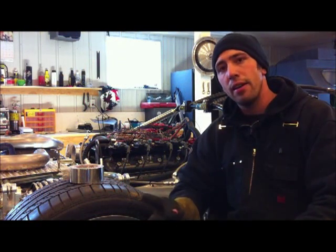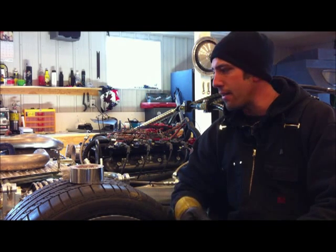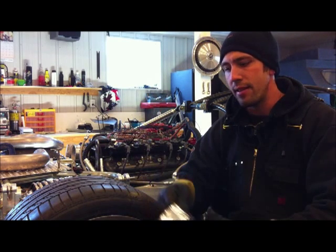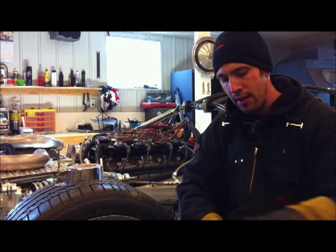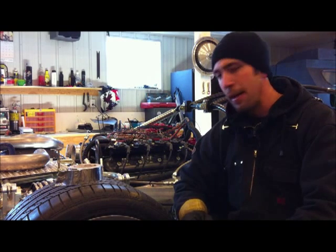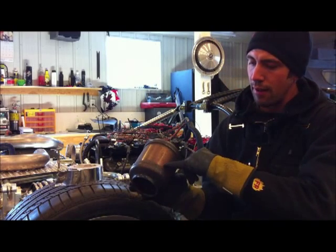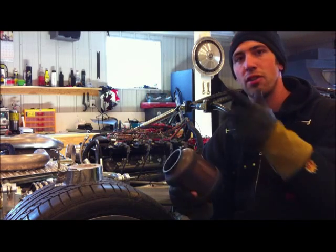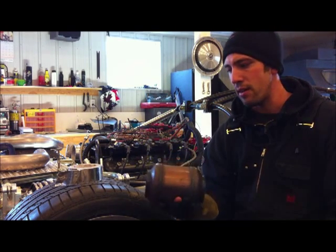Clamps are not going to work under this car. The best thing I can recommend is foil tape. Don't underestimate it. If you tape halfway around a pipe joint, it will be enough, 1 section at a time, to support that pipe before you can tack weld it in place. Also, there is a flow indicator when you're cutting apart stuff like this. Make sure the flow is going the right way. You don't want to weld this in backwards, or it's not going to work.